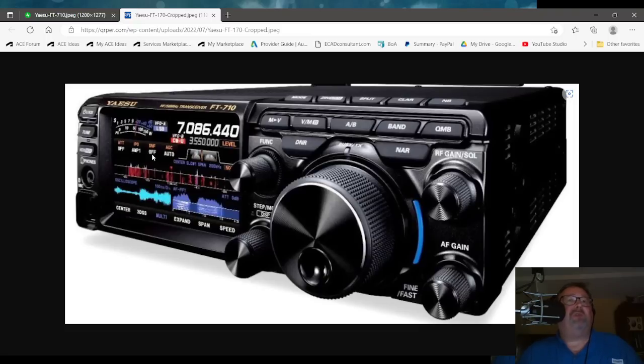If you've got yours left on, you may not notice that — you might just think that's just the way they sound, or it's the small speaker in the radio. Try turning the DNF off if you've got it on. It is off by default, but some people just automatically engage it and leave it on. It's Yaesu-speak for auto notch. The one in the FT-DX10 introduced distortion especially on stronger signals, so I just leave it off. If I need notch, I use the manual notch. So it's interesting that they've replaced the roofing filter button with DNF.